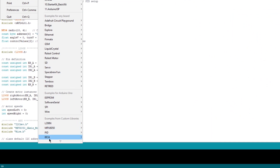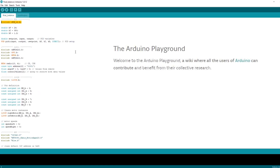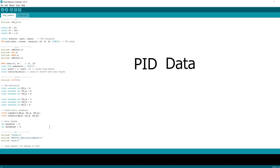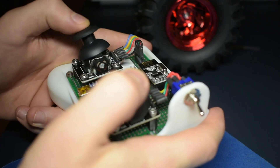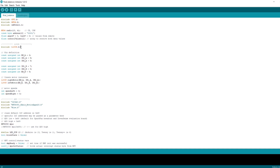I'm using four Arduino libraries, and I'll have links in the description for download. The first is the PID library from the Arduino Playground, which computes our PID data based on the input sensor value — the angle of the robot — the setpoint, which is determined by the potentiometer on the robot and our remote, along with our PID gain values. Next is the RF24 library. The NRF24L01 uses the SPI connection for communication to the Arduino, so we only need to initialize this RF24 object with the CE and CSN pins. We're also using an L298N library to simplify our code, and we create motor instances there.